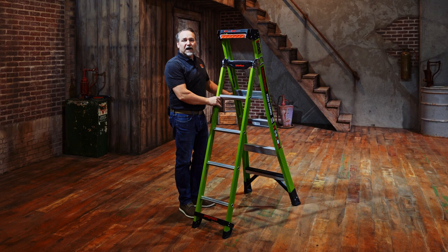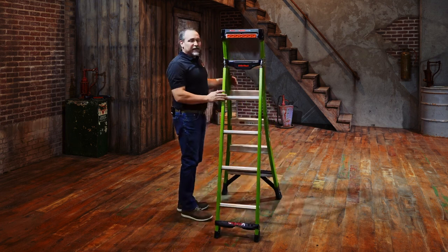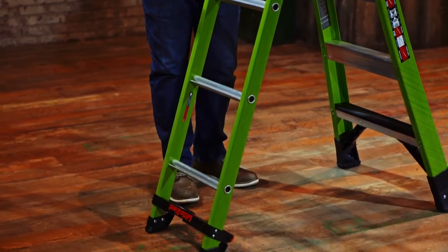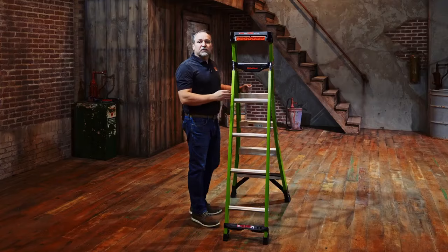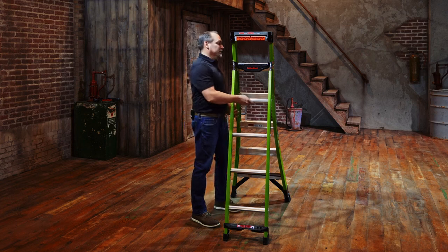What's unique about the King Combo is that the back legs are parallel, or 14 inches apart. So now the King Combo can safely be put in between wall studs that are 16 inch on center, safely putting the ladder close to the work so it eliminates the need for the operator to overreach. Closer is always safer.